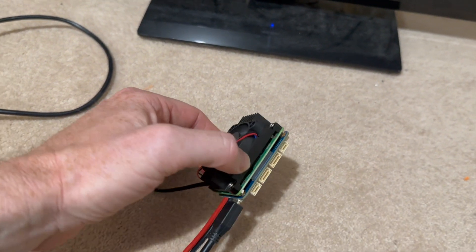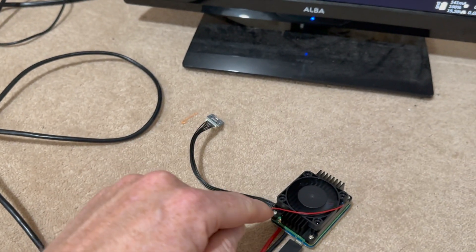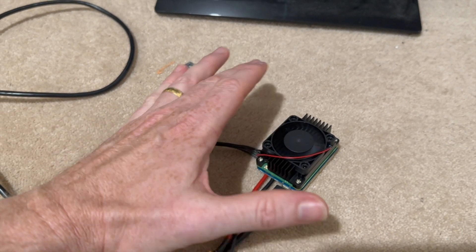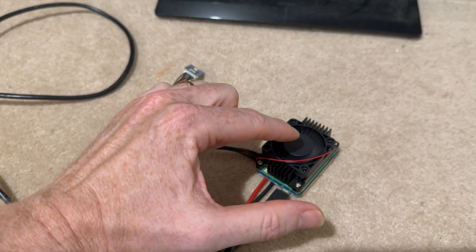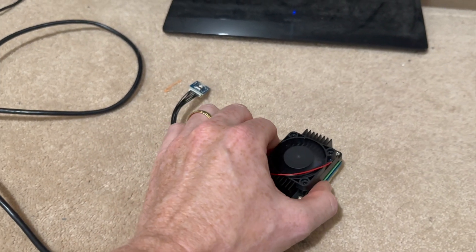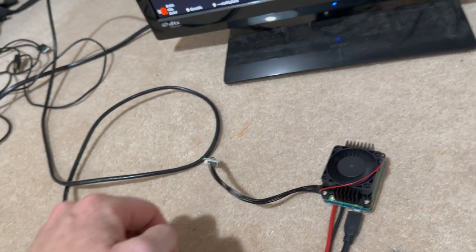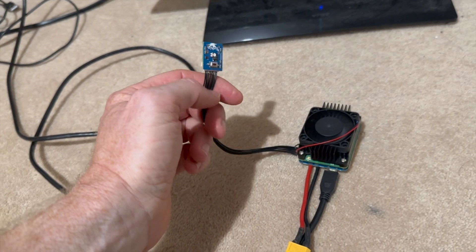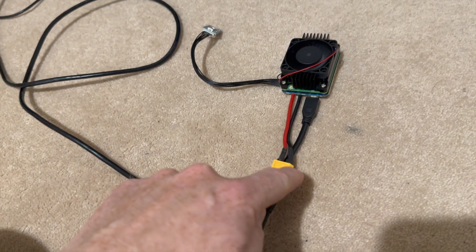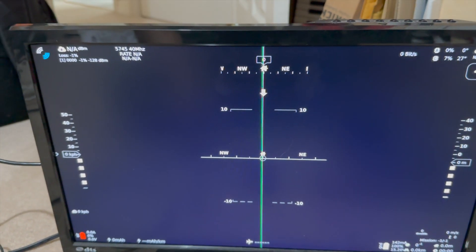I've got the Raspberry Pi Compute Module mounted on the Oaken board, and I've got this fan and heatsink. I talked to Flavio — I was going to put a regular heatsink on, but he said since it's going to be stationary you need active cooling. This is actually a PWM fan but I've cut the PWM control off and I've got 5V going to those terminals. I've soldered in a power cable, connected the HDMI, and we end up with this display here.